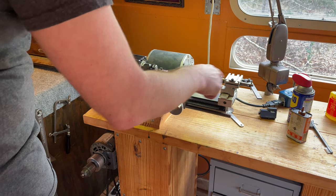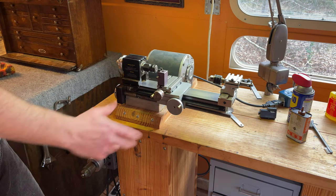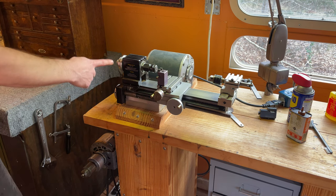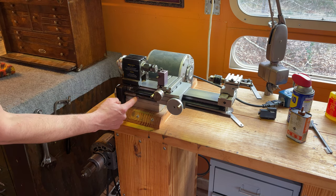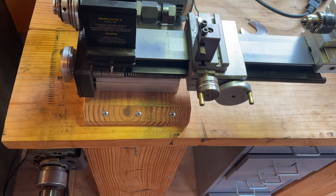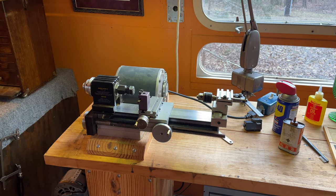You can see it's got all these Allen key adjustments, so if you want to move the tailstock you can. You can actually get an offset — if you get a lathe dog you can do a tapered thing. There's a power feed, but it's not a one-to-one thing — it's actually driven by a rubber band. And when it's engaged, that little lead screw is not firmly attached; it's attached by a bit of a spring, so it's got a bit of give to it. It's fairly handy for making a nice long, smooth cut.